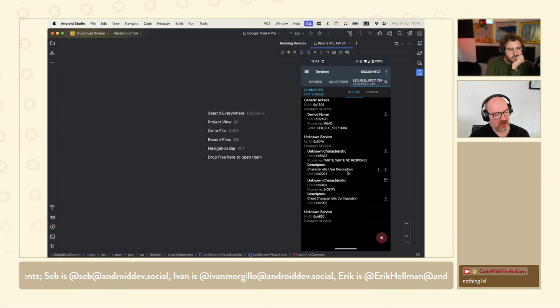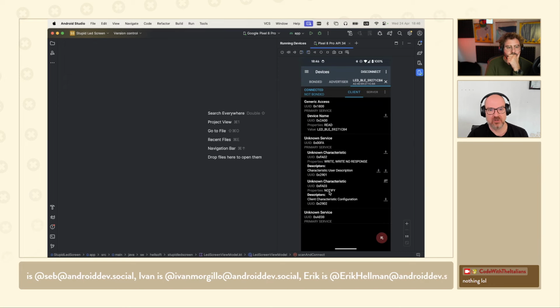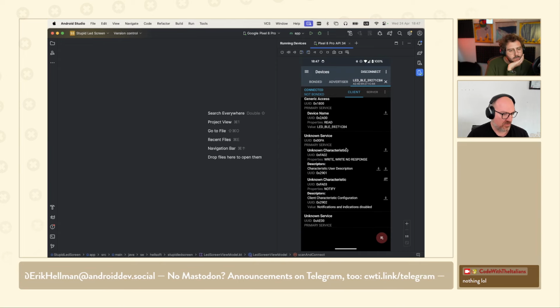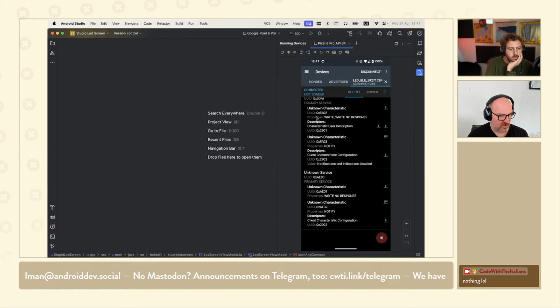And then we have a notification characteristic. Notify is basically where you subscribe to it and you get updates. That's the way the peripheral can send data back to you. You subscribe to a characteristic that allows notifications, so you can enable them here. Notifications are enabled. And when I write a valid value here, it should give me something back on this notification. Okay, so this is basically the part there. There is another service down here, and it's very similar: no response and then a notification, but no other characteristics that I can get a name from or anything.